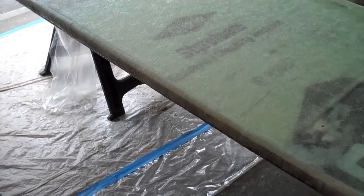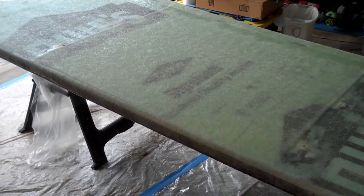I have some holes where the stainless steel screws go in, but it is kind of right at the edge of the hole, so I'm just going to file just a little bit off the side there, since I'm going to have a file out anyways. If you follow this pencil line, you can see how one of my pontoons is just a little tiny bit wiggly at the front here. So the spar I have on the front will maybe be just slightly shorter than the rest of them.